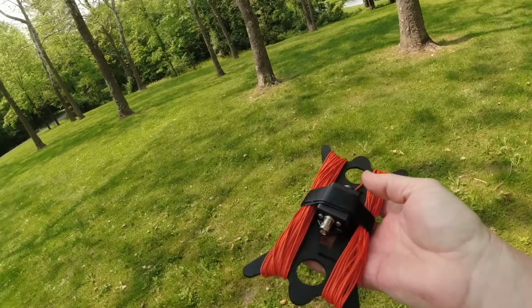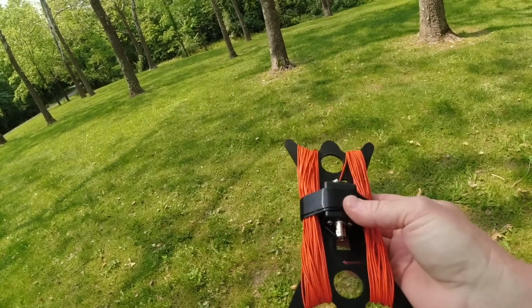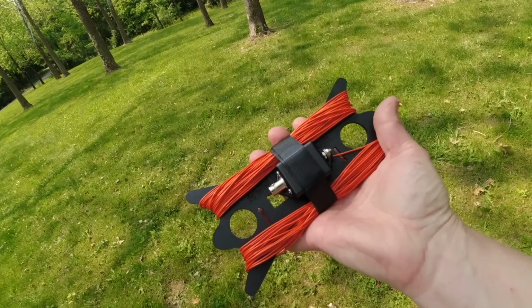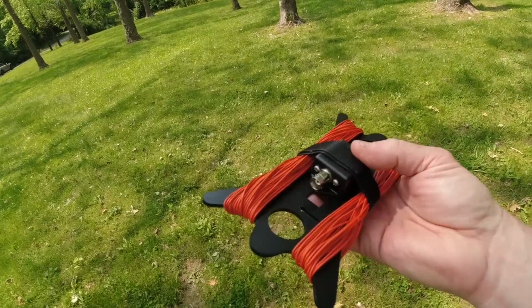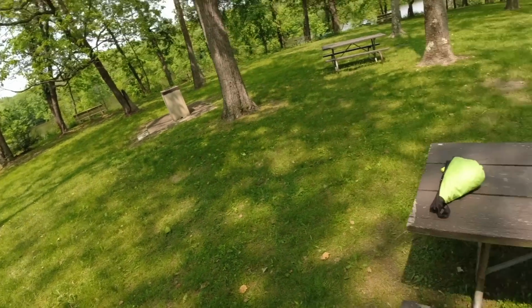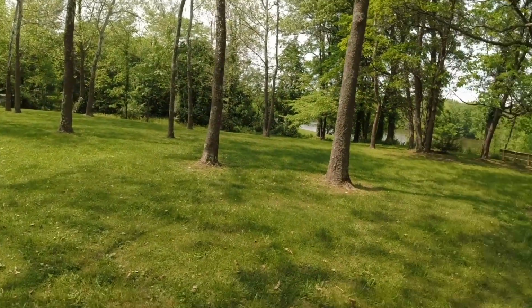So I got some wire out that my buddy Vlado gave me at one point, wound it around this, and stuck it in the bag. So this is a 40-meter end-fed half wave. It should be good on 20, 15, and 10 as well. And hopefully it'll treat us well today. So let's go ahead and get the activation started by putting up the antenna.